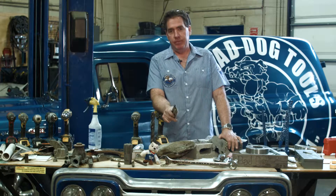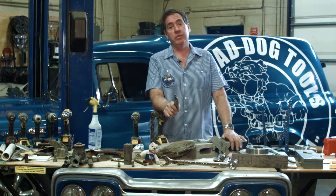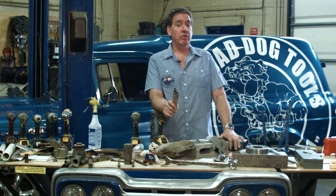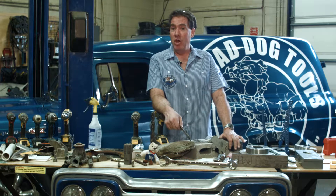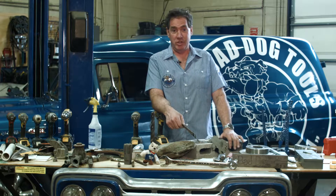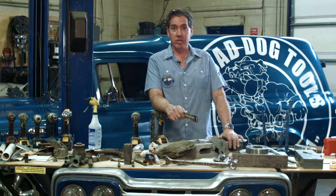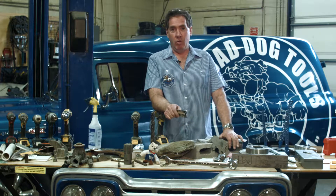This video is to help you drill stainless steel. The problem is there are 200 to 500 series stainless, plus stainless steel can be hardened and work hardened. You can have a piece of 316 stainless, bend it around, drive over it with your forklift a few times, and the next thing you know it's a lot harder than a brand new piece of 316. So there are no two pieces of stainless steel that are the same toughness to drill — they range all over the place.